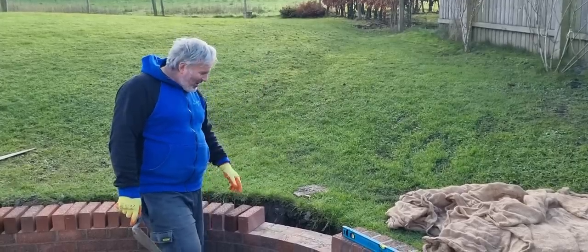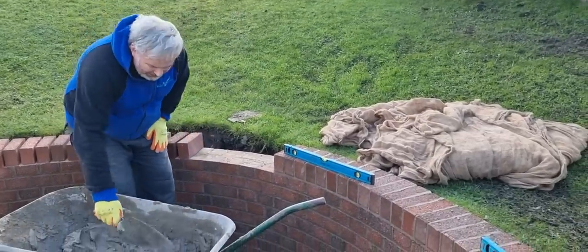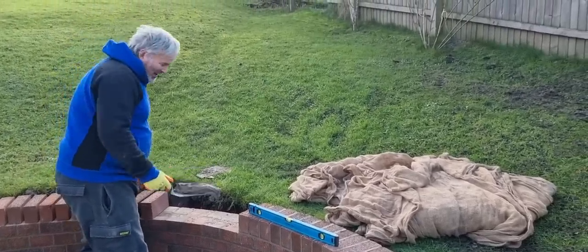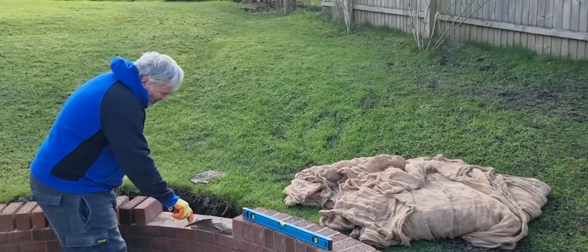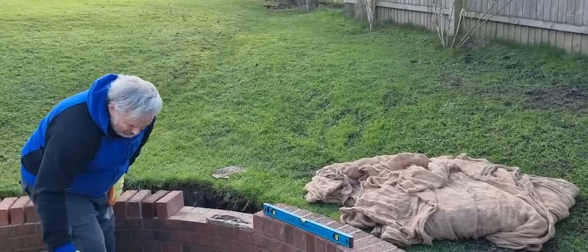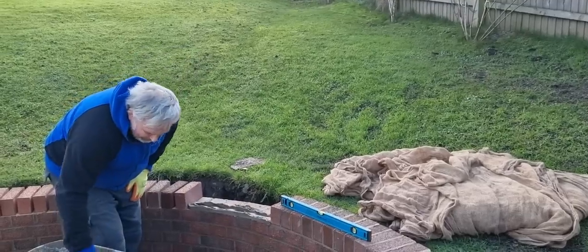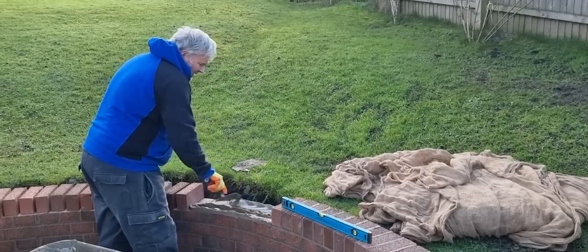Anyway, no. Brick on edge. So we're coming around here now. Brick on edge. Basically, again, it's all on the spirit level. Jay's done a lovely mix. We've got a wall tie on there now, tying the courses in. Again, what I tend to do, don't go too far ahead of yourself. We'll just do five bricks, right? So bed up, five bricks. Just keep it nice and simple.